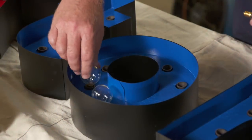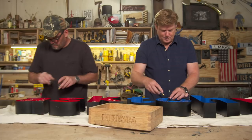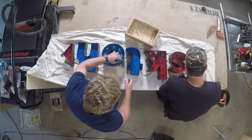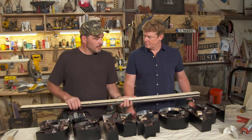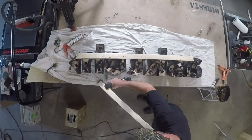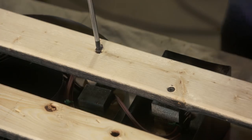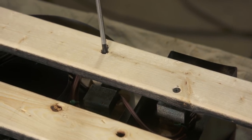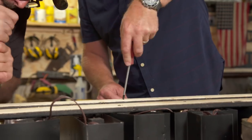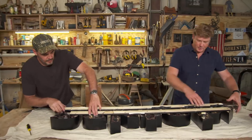These are interior-exterior lights, but this is really going to be just an interior sign. I've got some half by two inch strapping — we're going to use these to keep the letters together. I'm going to drill through this so we're not struggling with the screw, and then we just have to line them up to hit these little blocks — our spacers that we put in earlier. All right, you ready to give it a look? Let's give it a flip up.